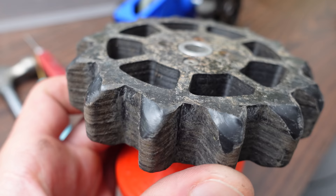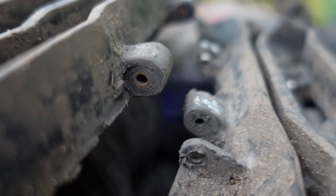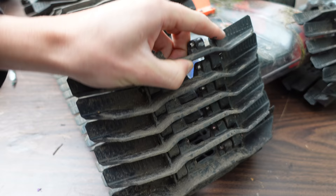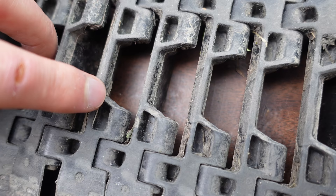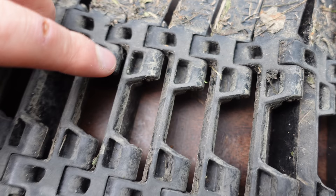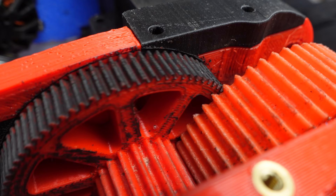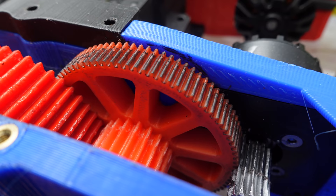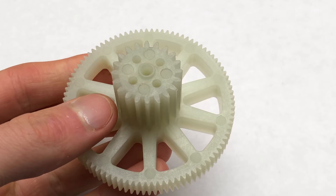After a few days of this, the wheels were showing significant signs of wear — probably just from turning in one direction the whole time. On the track links there are little grooves from bits of sand and dirt getting stuck in there, but the tracks were holding up really well. The bronze bushings and shoulder bolts were holding up especially well considering I hadn't even lubricated them. Some of the nylon was getting worn out pretty quickly from the constant turning — the edge gets kind of sharp where the wheel has been wearing it down. But most people probably won't be turning in the same direction for days, so I don't think this will be a problem with the kit.